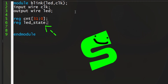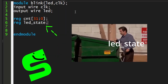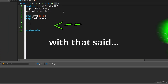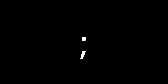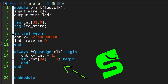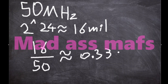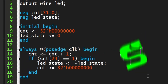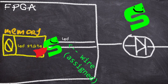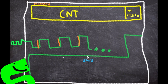And as for our LED state — remember, the LED is just a wire. You can't really do any operations on it. But our LED state stores the LED state, and now we can use that so when we want to blink, we flip whatever the LED state stores. We initialize the values as zero. And then always at the positive edge of our clock, we add one to our counter — aka we count. And then after it's counted two to the power of 24 times, which with a 50 MHz clock would be about a third of a second, we flip the LED state. Then we reset the counter. And before we forget, let's assign LED to LED state so we can actually see it blink. Assign is just a keyword to route a wire from source to destination. Remember, this is not a script or a code — this is just describing the circuit that would do this.